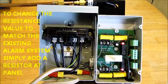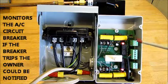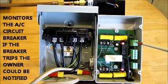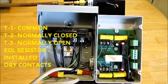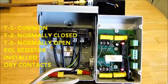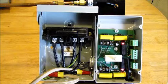The supervisory points are monitoring the circuit breaker, which is indicated by this LED here. The alarm company would connect a pair of wires through terminals T1 and then either T2 or T3, depending on the configuration they want back to their panel. T1 to T2 is a normally closed loop, and T1 to T3 would be a normally open loop. The options are endless for reporting back to that panel.